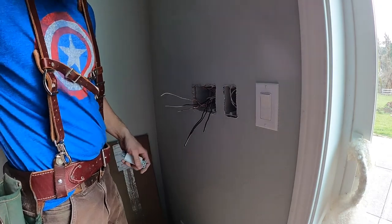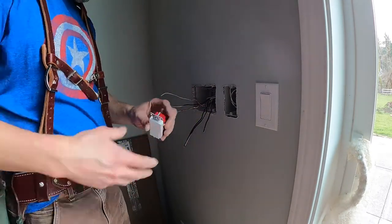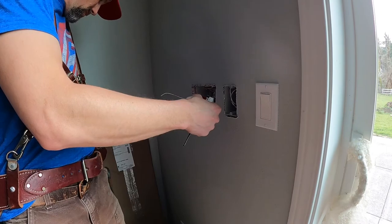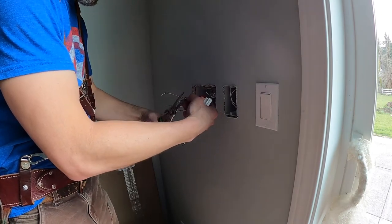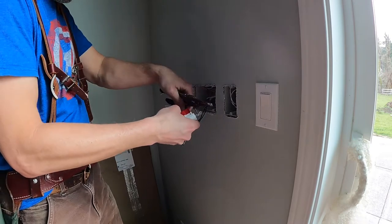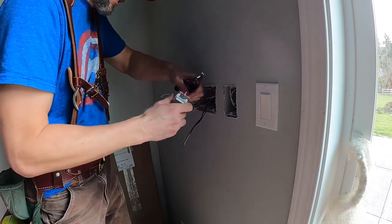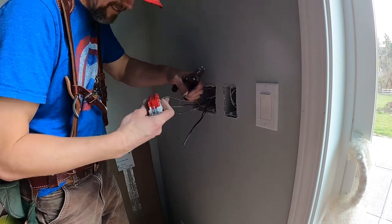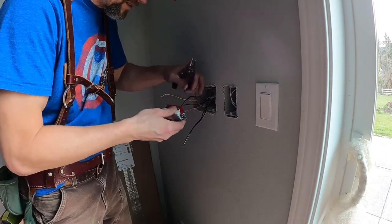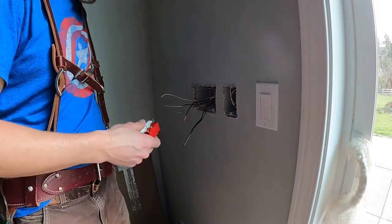We've got our switches. It's a 20 amp switch, because it's going back to a 20 amp breaker. That's important. Incoming power is going to be down on the bottom. It actually has a wire stripping gauge. With this particular one, some of them you can just shove the wire into it like that. Nope, there we go. It still requires it to be crimped. Other types you can just shove it in and it's in there. This one's different. So let me get that.